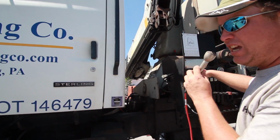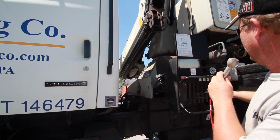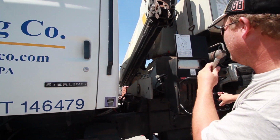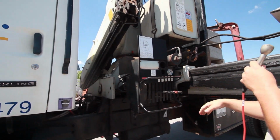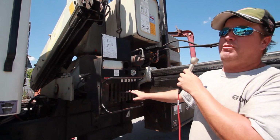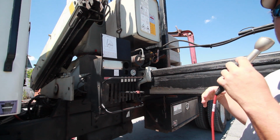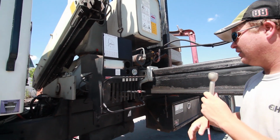When you reach that point of the truck, right about where the boom's at now, you'll want to throttle down so that everything can slow down. You're going to boom down in, and that'll sit into place. There's a little knob on the end of it, and there it is in place. Everything's folded up. You just push down on all three of these levers just to make sure everything is securely put away. Then we'll step back and we'll reverse what we have already done with the outriggers to put them away. Can you say what all the levers are while we're in here?